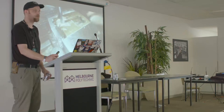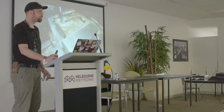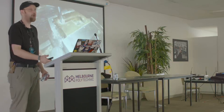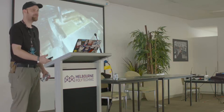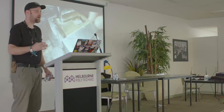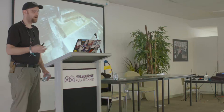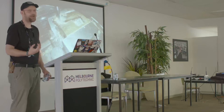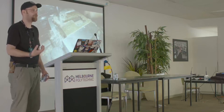I love the brass Lockwood uses — it cuts really clean. A lot of Master Locks — the re-keyable locks — they put an abrasive in the metal and it dulls end mills really quick, and you end up with a really rough-looking result. That's because there's actually a grit in it because they're trying to stop people from drilling into them.